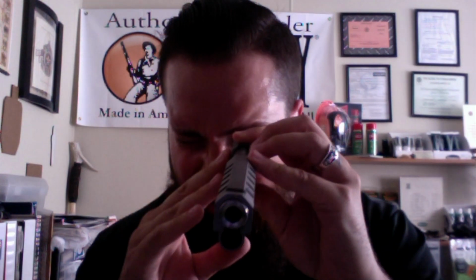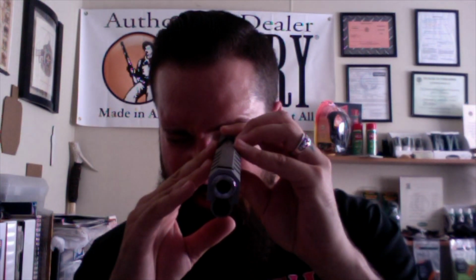what will have to be done still is, everything looks perfect. Ooh, I can see myself right through there, so it's a straight line through the firing pin hole out the barrel. But what needs to be seen more is making sure that that casing, basically where the primer is going to live, is centered in that hole. So one way to do that is with a go or no-go gauge, or a spent casing.